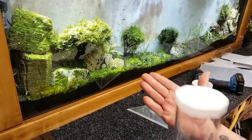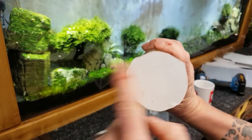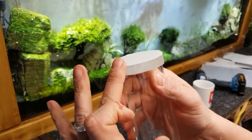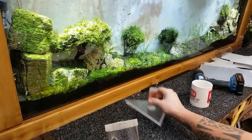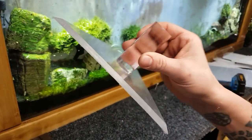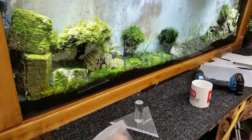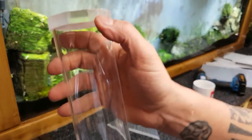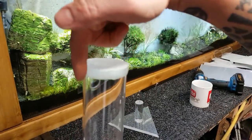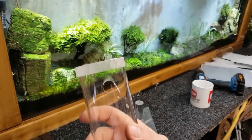That bit's all dry now on the top — all gone off nice and solid. I've just taken off the corners now and cut my finger — not on the saw, on the edge of that, believe it or not. Very sharp acrylic — when I was scraping the edge it's like a blade. Silly boy didn't put a glove on. So wear gloves when you're doing that — there's a tip for you and you won't end up with a finger like mine. Now we can get the router and run that around there to make that nice and flush.